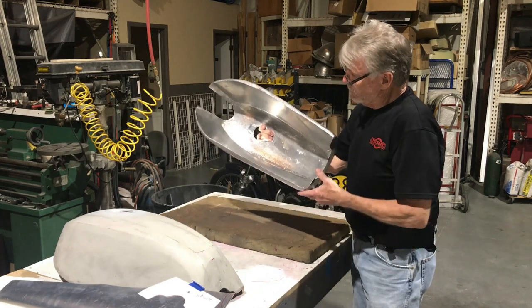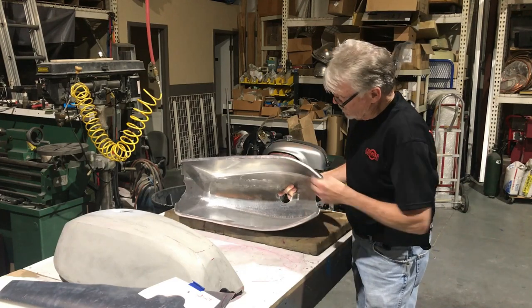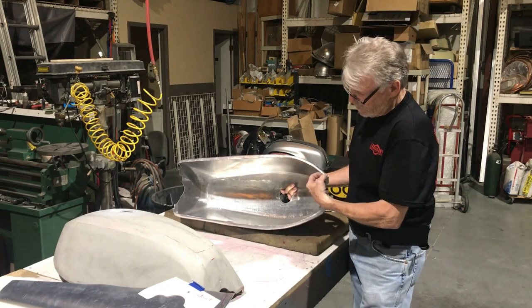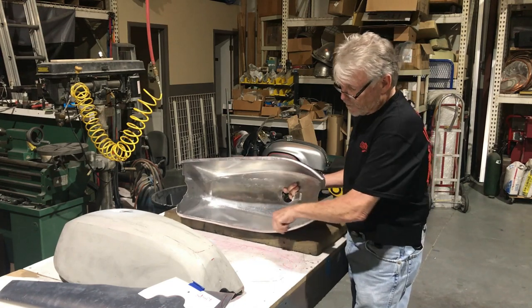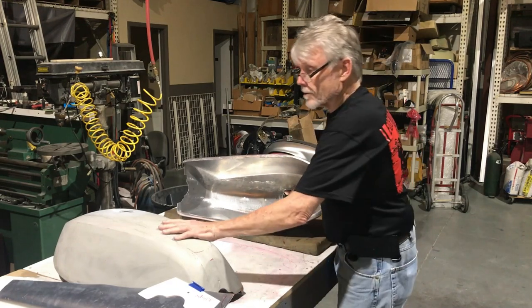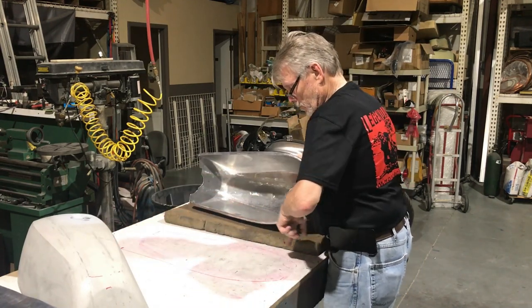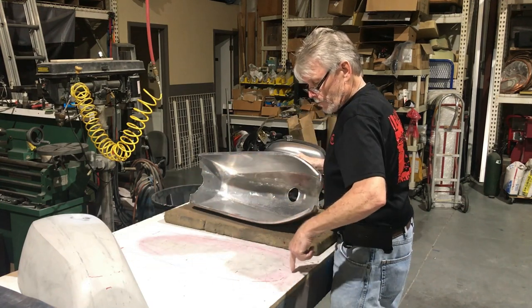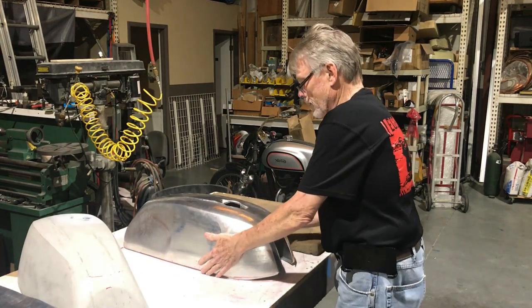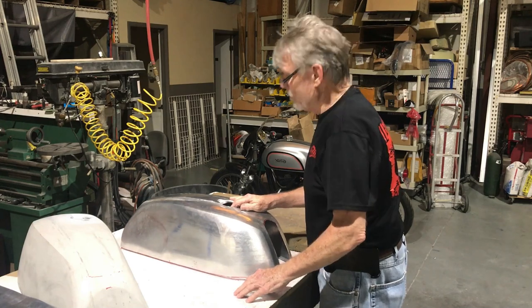Probably the best part about this — it's hard to maintain when you're trying to tip this edge over on the bottom because it wants to straighten out, so you're constantly stretching and shrinking the flanges on the outside of it. To get it right, it's got to fit on the motorcycle a certain way, especially these Commando frames. What I'll do is take the original tank and draw out with a felt-tip marker the profile of the bottom. That way I can keep coming back and checking myself — making sure it's wide enough in the correct places so that it fits on the frame.